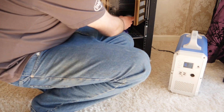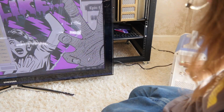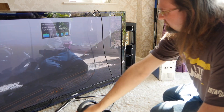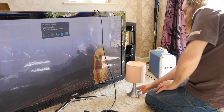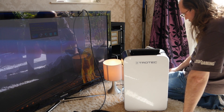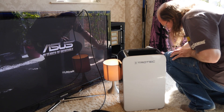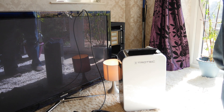To test the power discharge, I fully charged it up and started plugging things in. I added a gaming PC and then a 44-inch plasma screen — even when pushing the graphics card running Half-Life Alyx, the PSU in the computer was only pulling around 300 to 400 watts, and the total draw was around 650 watts for the whole gaming PC running a game and the plasma TV. I then plugged in a lamp, but that still wasn't enough so I grabbed a dehumidifier which was supposedly 150 watts. However, it apparently had a much higher peak than that, and as soon as I tried to switch it on, everything cut off. When I turned the dehumidifier on first, that peak was within the limit, and then I was able to turn everything else on — the plasma and the computer — after that.